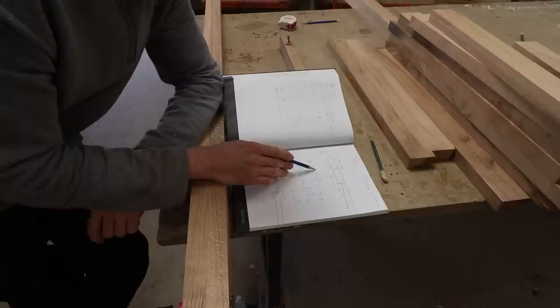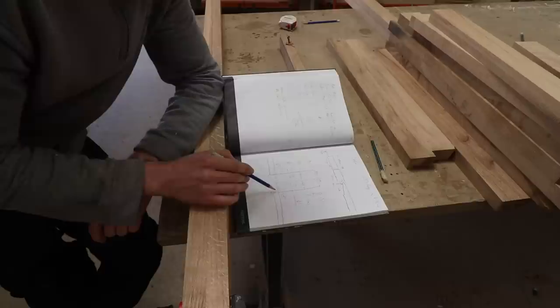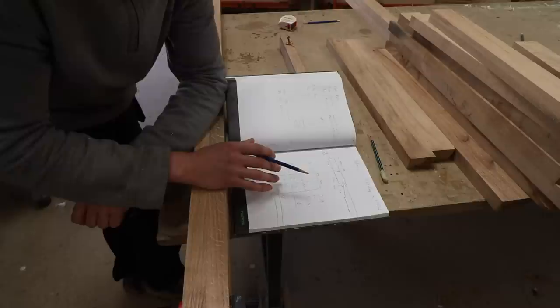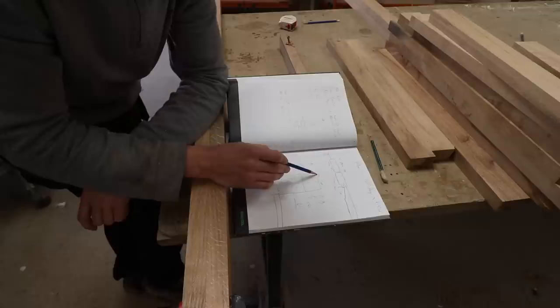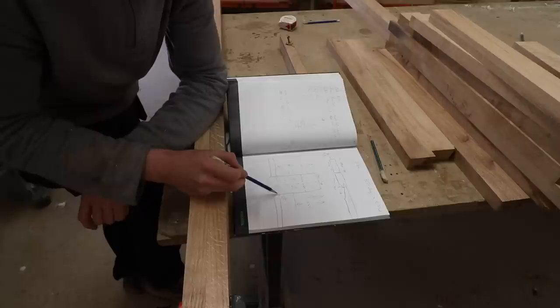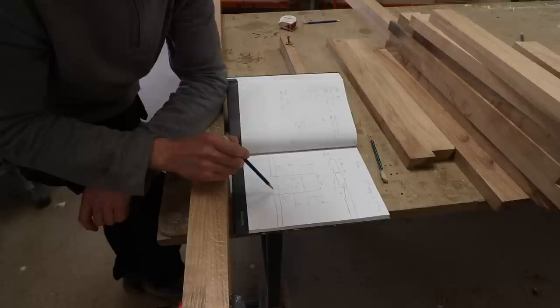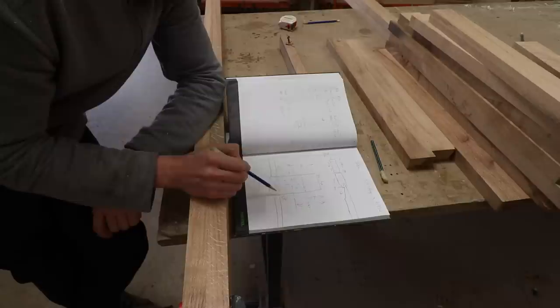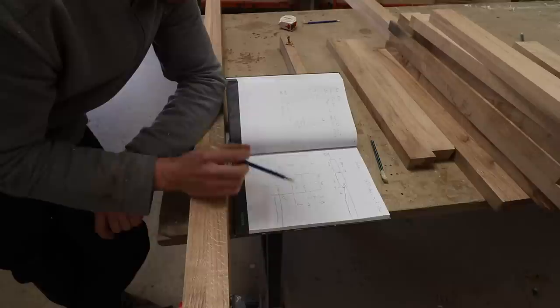If we follow that onto the other side, you can see it's slightly out of level in the other direction this way. So we've got a 323 measurement at the bottom and a 318 at the top. So if we wanted a frame to fit perfectly in that opening with the scribes, so it's tight all the way up both sides, we're going to be looking at making it 349 wide from the line that side and 323 wide this side. So we know that if we add them two biggest measurements together, we will have a frame that will fit in that opening once it's been scribed in place. If you just rock up to site and take a measurement across the width of the opening from there to there, it's going to be too small to fit in once you've done them scribes. You're going to have a bit of a gap. So it's a good method for measuring up, and it's what I've done here.